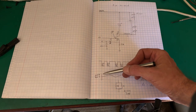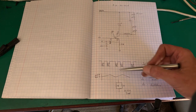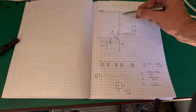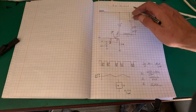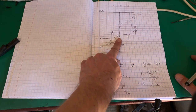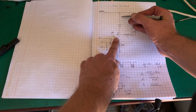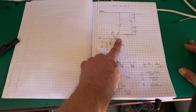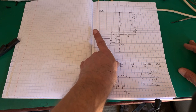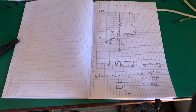The inductor for that circuit, what we expect to see is the ripple current doing that. So it's never going to zero. In other words, there's always a constant current flowing through here. Even when that switches off, the FET can switch off. Remember, the inductor has now built up a magnetic field. The FET switches off, the field collapses, it's fine, the current will still flow. And that is what this is doing. Off, on, off, on, off, on, off, on, to give us that wave through our inductor.